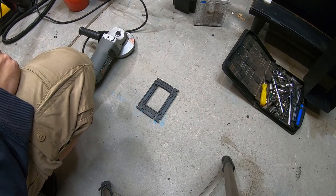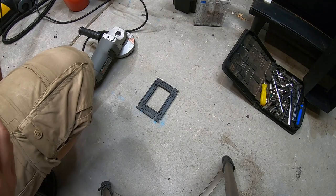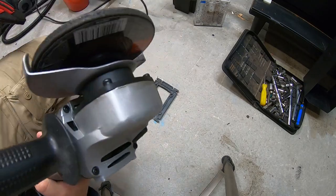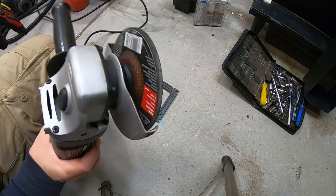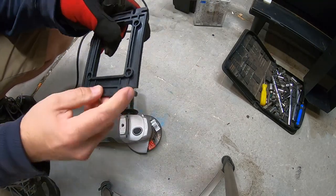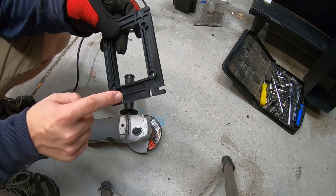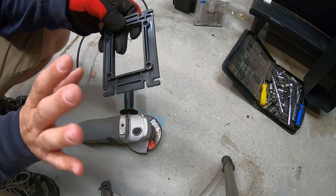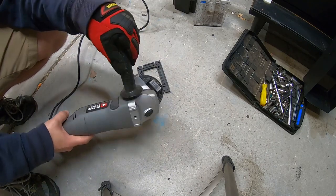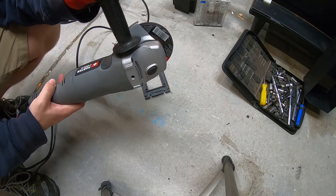This next step isn't for the faint of heart. I'm actually using eye protection, ear protection, and I've got a glove on one hand so this tool doesn't hurt me. This is just your basic grinding wheel grinder. I'm going to slim down the four spots where our bolts are going to go — these two bottom ones and these two top ones. I need it to be thinner in those spots. This is pretty noisy so I'll probably put some music over this. Let's go ahead and grind these down a little bit.